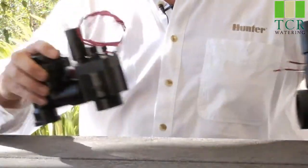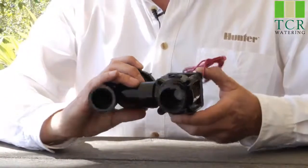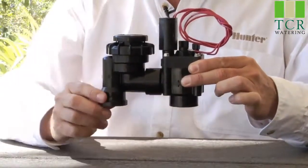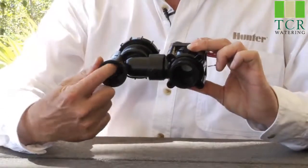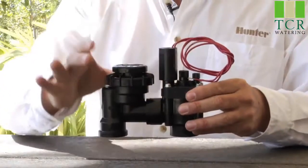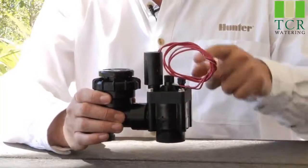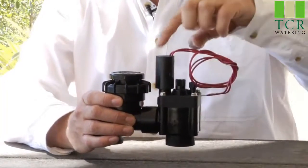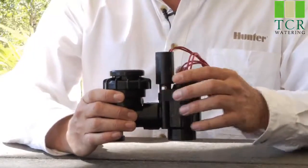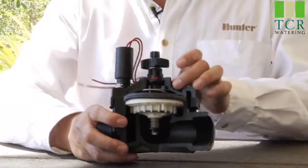You might also have something called the anti-siphon valve. This is not an inline valve that goes in a valve box, but mounts above ground — usually about 16 inches off the grade. This happens to be a slip-joint style, but it works off the same premise. The front half is the anti-siphon portion, and the back half has the body, the diaphragm in between, the same flow control, and the same solenoid and manual bleeder screw. This is held down by four screws, while the larger ICV inline is held down by six screws.